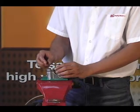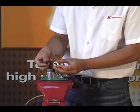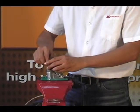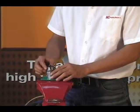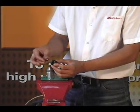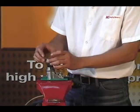Now insert the pinion gear into the end of the rotor. Place the 3 planet gears onto the reduction spindle. Put the reduction spindle assembly onto the motor assembly. Now place the internal gear onto the housing assembly. Place 3 planet gears onto the work spindle. Place the planet gear assembly onto the end of the reduction spindle. Now install the other internal gear onto the housing assembly.